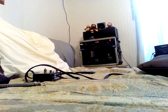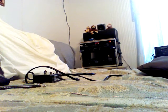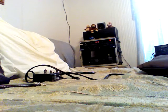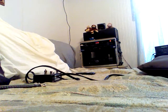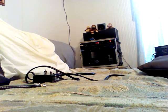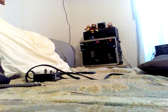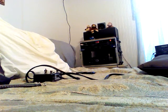I used this for a couple of projects, including a SCA antenna — which is disconnected — the ST2, which uses 75-ohm coax. A lot of antennas for receiving can use 75-ohm; you can use a good RG6 quad shield. It's very low-loss, inexpensive, and thin for receive purposes. This house has had a cable line that goes through the floor, and I untapped the connection and piped it into my scanner antenna. I don't really need it here because I'm close to the coast, but where I used to live was kind of a rural area, way out in the middle of nowhere, so sometimes this might help.